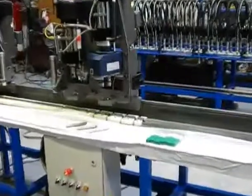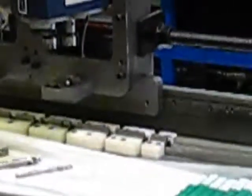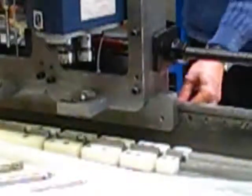In the main setup bar, there's a series of dowel pin holes. We're showing the pins back. So you lock the pins in. There's two sets of pins. There's one that's just a locator, essentially, to get your dimension accurate within a few thou, and then there's some bolts to actually bolt it, clamp it into place along that rail. That's a 1-inch thick steel bar with the holes position plate mating into the tire assembly that slides along.